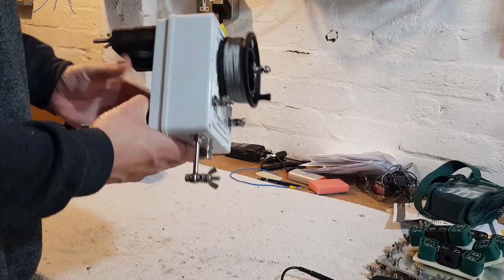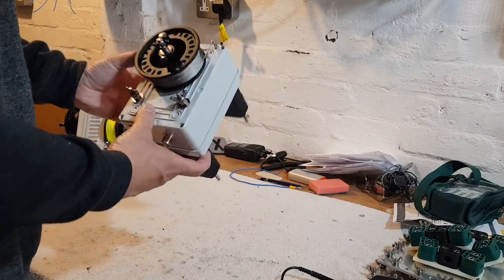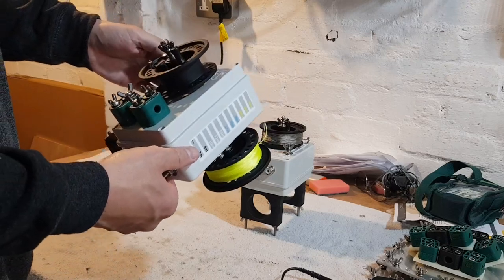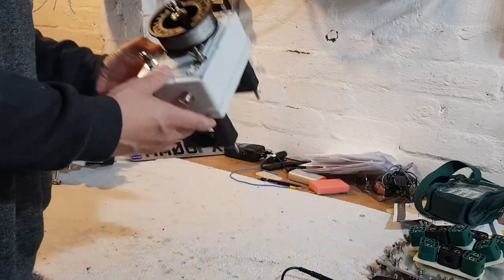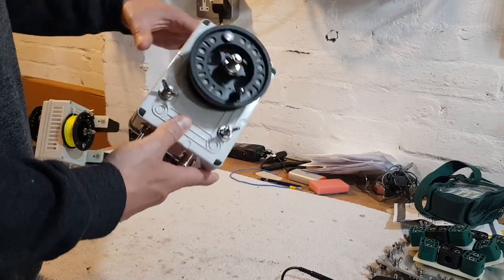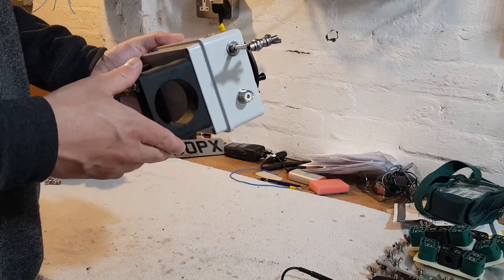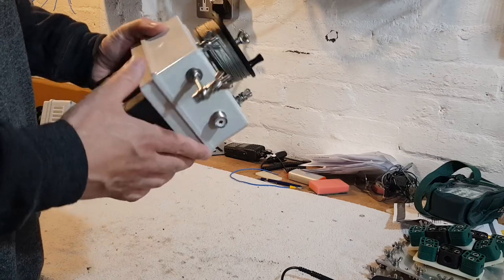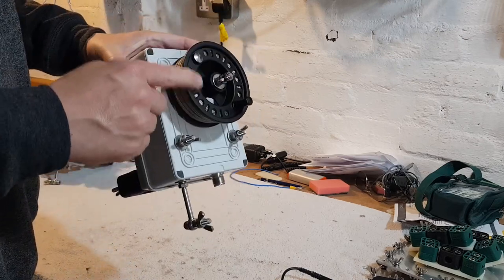I will be launching this on the website in the coming weeks, and I think it will represent very good value for money. The AdjustiWave Essential is on sale for £109, and this will be a bit cheaper — but it's still a quality unit. It shares many features from the AdjustiWave: all fittings are stainless steel, the SO239 is PTFE dielectric with gold-plated contacts, the wire is 316 stainless, and it uses the existing reel.